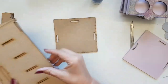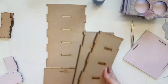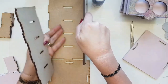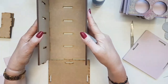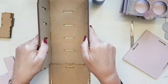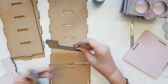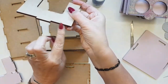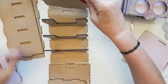This is our base and the notch goes to the back. I would do it flat — leave the base here and put this together on the flat. The back of the unit goes on and then you've got two sides that slot together. Before you put the sides on, put your shelves in first, because putting your shelves in after adding the sides is going to be more difficult. Put the glue on the recesses and then fit them into the notch — that holds it quite securely.